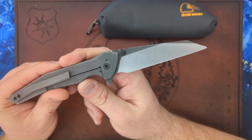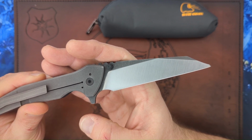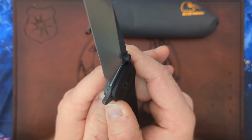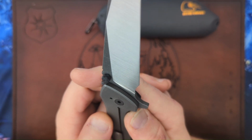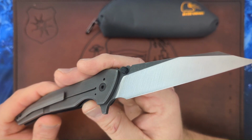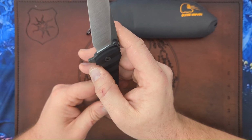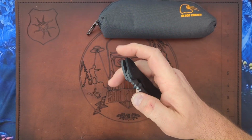It's really good. Nice grind line, more angular than vertical grind lines on there. I think he said it's a 320 grit, so if you're into the belt satin type lines there. He did mention that the plunge grind is off slightly. To my eye, I'm not picking it up, but he did mention that in the sheet. He said it's something that he's addressed. I think he said it's 0.01 or 0.02 millimeters off on the plunge grind. So I guess I take back that statement. Everything's perfect. I'm not going to pick up a 0.01 millimeter plunge grind being off. In my opinion, this is coming out just fine. But again, he points out his own imperfections, and he's trying to work on stuff.